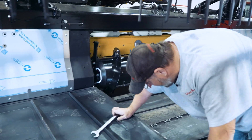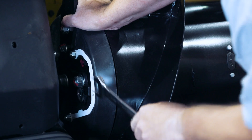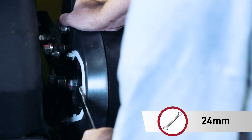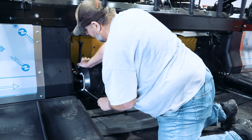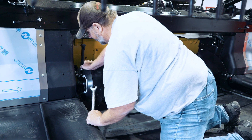Crawl in — just to make all the safety people happy — got my boots on. You're going to see an A position and a B position. To adjust that, you'll loosen off both of these nuts with a 24mm wrench and then rotate to A or B. We're going to move over to our display stand to make this adjustment and show you the difference between A and B — it's just a little bit easier to see outside of the combine.